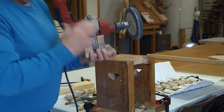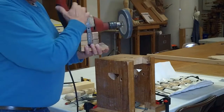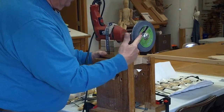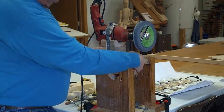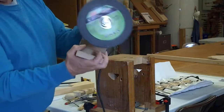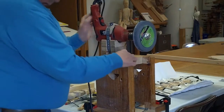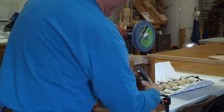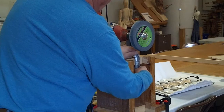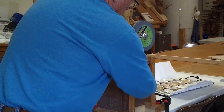And they're cheap. So I just have a box — just anything to raise it up — and we're going to use the flat surface here for the grinding. I've got a piece of wood with a little fixture to hold it so it doesn't pivot and move around. I'm just clamping the drill into place with a C-clamp that's going to fasten this down to the box.